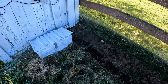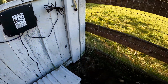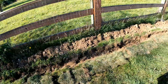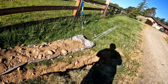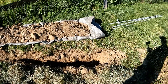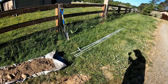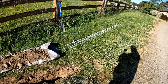The trench comes all the way down to here and it's going to get wired into our box right here. I dug it all out yesterday — I dug most of it out with that little trenching shovel, and then the deeper area where the sensor goes into, I got out my post hole digger. I also got some conduit, which you don't need — the wire is direct burial wire — but I figured this would protect it a little bit since it's not going to be very deep.